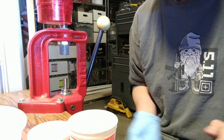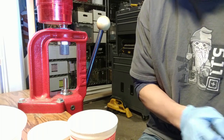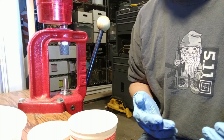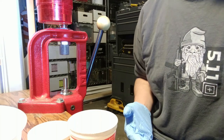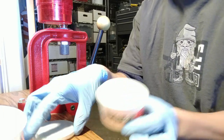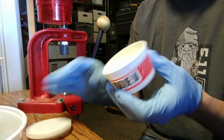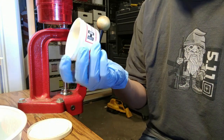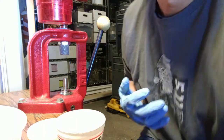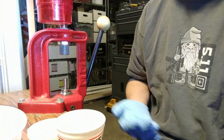When I have bullets that are pretty tight — oversized bullets where the powder coat is a little thick — I like to make sure to lube the bullets before sizing them. One of my favorite ways to lube them fast is to just use some sizing wax, or something like this Hornady Unique case lube. It lasts forever. I just put on these gloves, get some on my hands, rub the bullets, and then good to go.